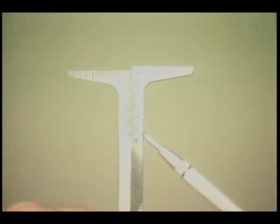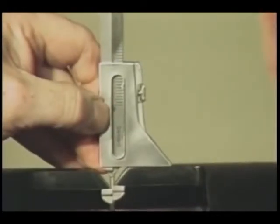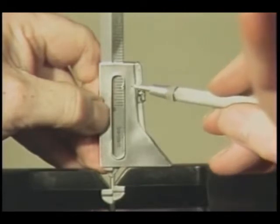Next, pull down the gauge until the internal alignment stops are snug against the inside of the pipes. Read the misalignment on the scale. You can use the same procedure to measure pipe wall thickness after fit-up. To obtain this measurement, use the material thickness indicator and this scale.